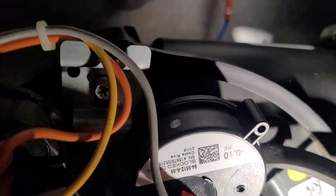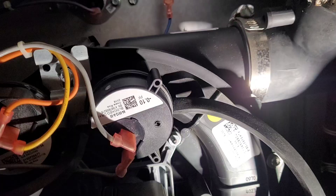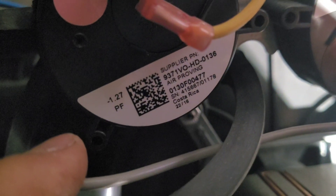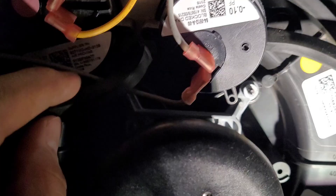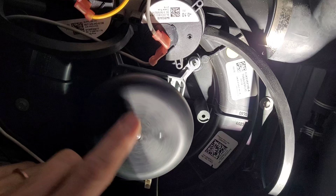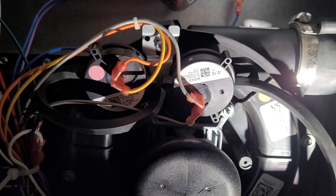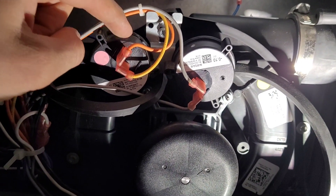While we're on the subject of pressure switches, this one here is a 0.110 and it's used to indicate a blocked drain — it goes right down to the bottom where the condensate drains out. If it backs up from a plugged condensate line, this switch won't open or close. This one right here is the air proving switch, which goes directly to the combustion blower and verifies that it's running and moving the correct amount of air. Any restrictions in the pipe or damage to the blower wheel could prevent this switch from operating.